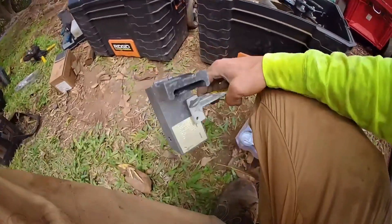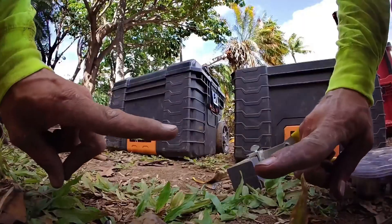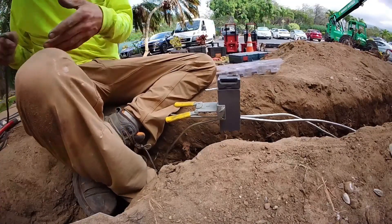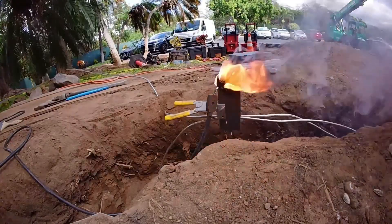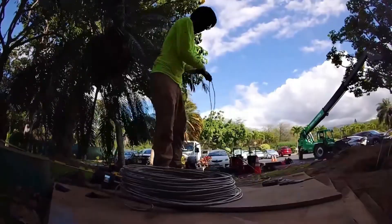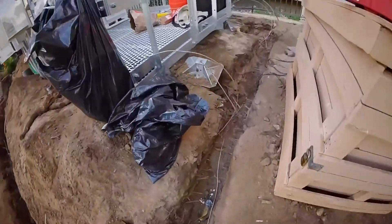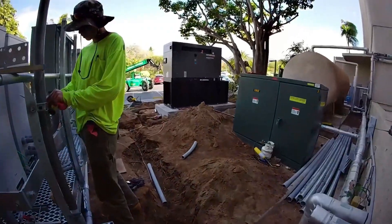If you want to see CAD welding in more detail and with bigger wire, check out my last video. Now we're going to use this run-and-tap mold. Essentially what it means is you can slide two wires in on that side — the wire comes in like that and it welds the two together. I have 16 or so whips laid out at every fence post, platform corner, gate post, two whips for the grounding electrode conductor, a couple whips for the generator and generator fence posts.